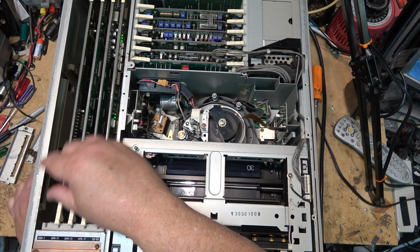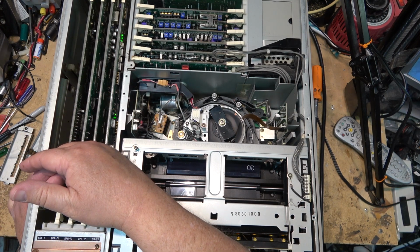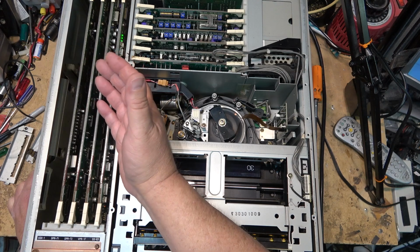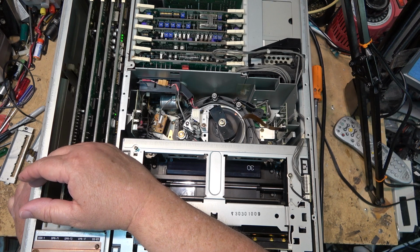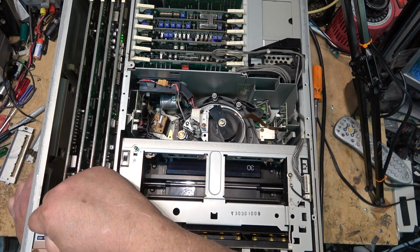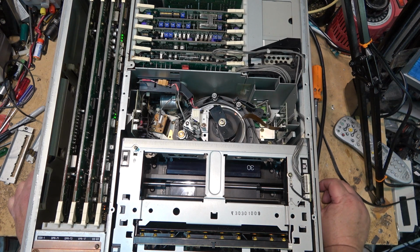So I know there's video coming out of it, but whether it's in the time-based corrector or the servo wasn't locking in, for starters. Even when I put it in freeze frame, I didn't get a picture. I just got a green screen when trying to play an analog tape. And I don't know, is that board important? Was that something that was omitted on this one because it doesn't play analog? I don't know. It says analog digital on it. It says it's supposed to play it.